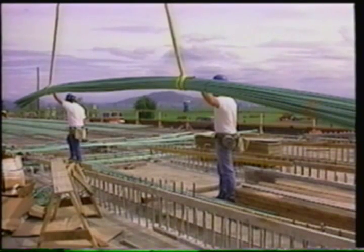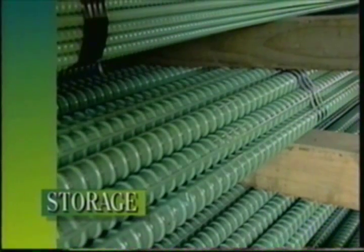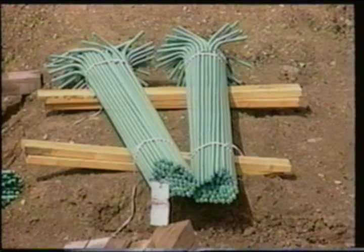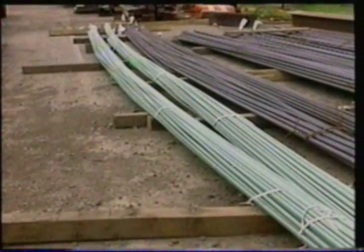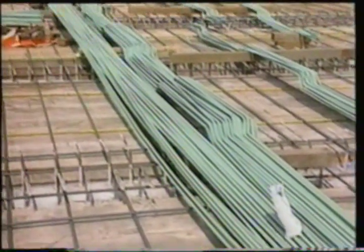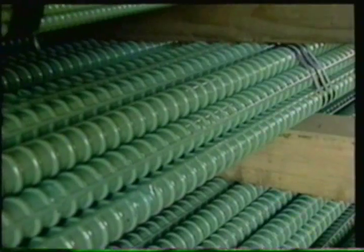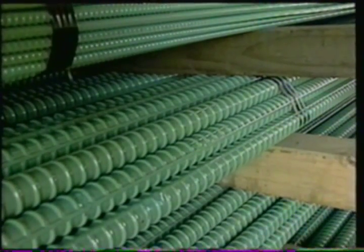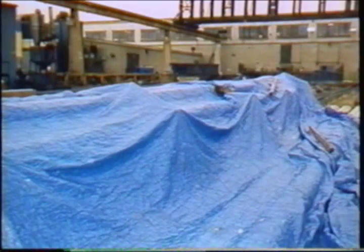This helps to prevent sagging of bundles which may cause bar-to-bar abrasions. When storing the rebar at the job site, always use wooden dunnage or other protective cribbing between the ground and the rebar to prevent sagging. Epoxy-coated rebar shouldn't be stacked directly on the ground or on other unprotected surfaces. Remember to allow aisle space between stacks to enable easy access. To avoid sagging, the rebar should be placed on a relatively flat or level terrain with timbers close together. If a relatively large quantity of materials has to be stored, bundles should be stacked with adequate blocking placed between the layers. If rebar is stored outdoors for more than two months, cover it with opaque plastic sheeting.